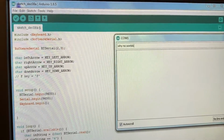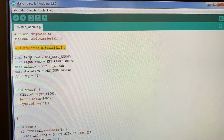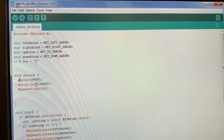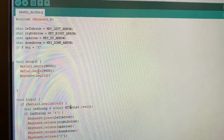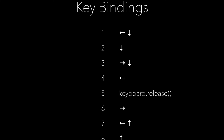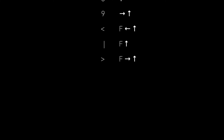We ran into a challenge when the Bluetooth data from Arduino Uno wasn't sending to the Arduino Leonardo. We later found that Arduino Leonardo uses serial 1 functions instead of software serial to read Bluetooth data, and incorporated that into our code. Each reading from the accelerometer and pressure sensor was paired in all possible scenarios of omnidirectional motion and in combination with the nitro function in the video game that we selected.